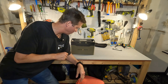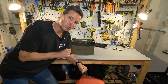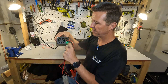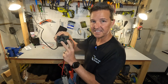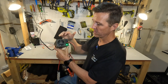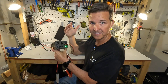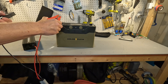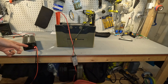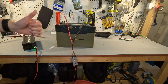I just pulled the Orion 1000 from GoldenMate out of the freezer and we're going to hook it up to a 20 amp lithium iron phosphate charger to see if it will charge when frozen. This charger has a green flashing light for standby, solid green for fully charged, solid red for charging, and blinking red for fault. Connecting it up — it started to charge for just a second and then shut off. That's perfect — this battery has cold temperature charging protection. Good job GoldenMate.